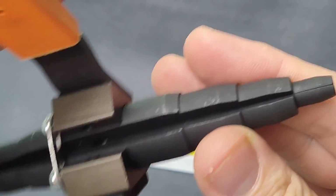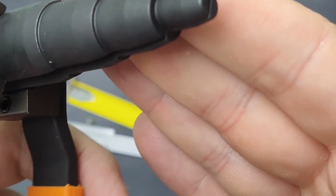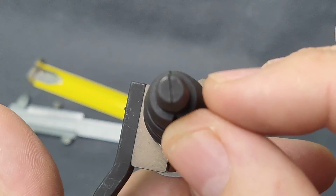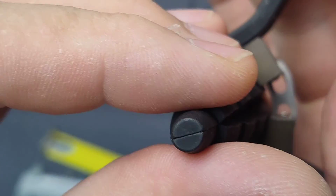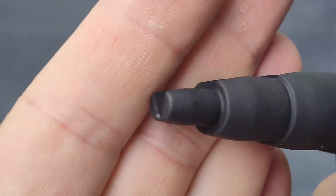As long as you follow several simple steps. One of them being, constantly rotate it as you expand. Don't try to expand the pipe in one go. Just expand a little bit, then rotate, expand again, rotate, expand again, rotate, expand again, rotate. So 4 points is exactly what it takes. It doesn't take too much force. It just takes a little bit of something to eliminate the friction.